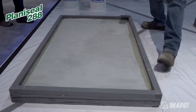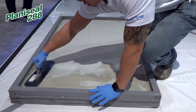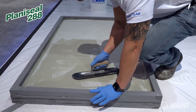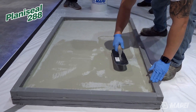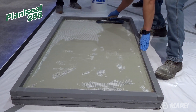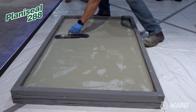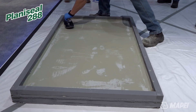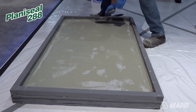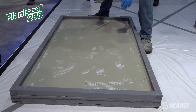Now we put down a mesh. The reason we put down the mesh is it reduces cracking of the product. Before you put down any membrane, you would repair any cracks in the substrate, but if there are any hairline cracks you missed, putting down a fiberglass mesh prevents them from telegraphing through the final wear surface. Using a pool trowel — rather than a square edge trowel — makes it a lot easier and more forgiving, because catching a corner with a square trowel can pull the mesh up and you'd have to start over.